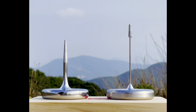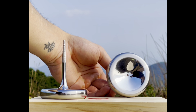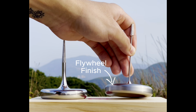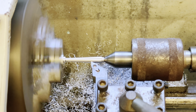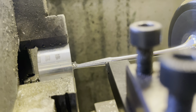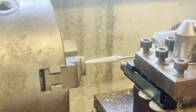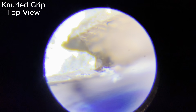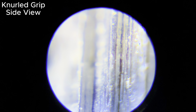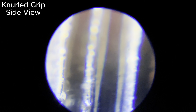In the last video, we looked at Mark 23. The biggest changes there were with the aerodynamic underside and lighter stem. However, the flywheel finish wasn't great, and the knurling was quite poor, so these were the main areas of focus for Mark 24. I made the knurled grip as a separate component, and instead of using a regular knurling tool, which struggles with conical knurling, I made straight grooves with a kind of metal planing operation. As you can see, I've angled these cuts, which makes the grip grippier for a clockwise spinner like me. There's also an argument that this is a bit more aerodynamic than an unangled cut, but the difference it makes to spin time is negligible.